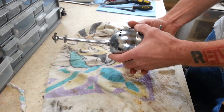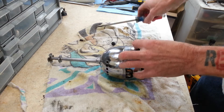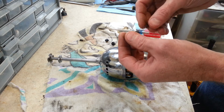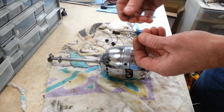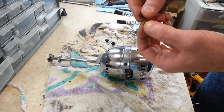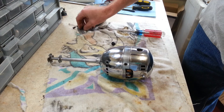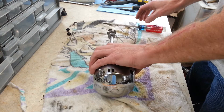They're pricey, so I'll order them up and we'll have the proper springs for the proper tension. If you don't have enough tension you're going to have a lot of arcing against the armature, and if you have too much you're just going to wear your brushes down really fast. These springs both look the same length but this one looks like it's stretched out more - I don't think they're even matching springs, and you can see the difference in brush length as well. So we've got those coming, and the caps coming.